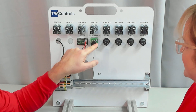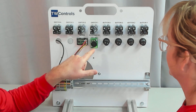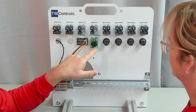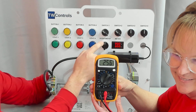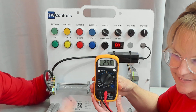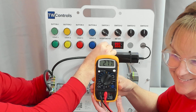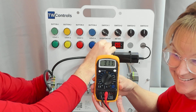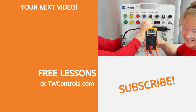That is the outside of this potentiometer. The center wire actually connects to the potentiometer wiper. Amber's going to connect between the middle terminal and one of the outside terminals. With it at about 12 o'clock, we're at two and a half kilohms — which is half of that 5K resistor. As I start turning it one way, our resistance goes up. Turn it all the way, we end up at five. And if we turn it the other way, it goes down, and eventually we'll get down to zero.